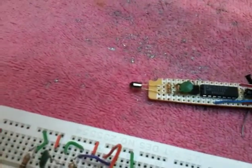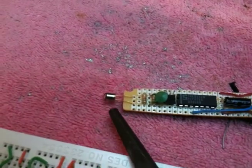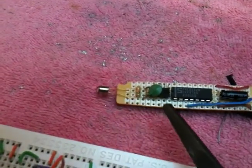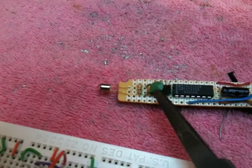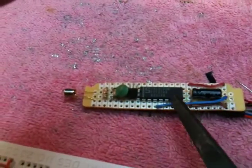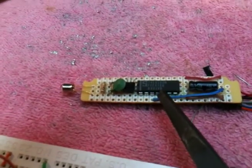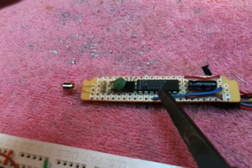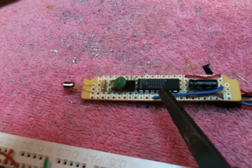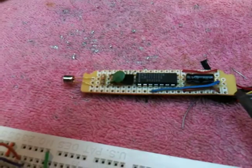There's the phototransistor at the end, I'll use my file to point to this. That's the phototransistor. There are 3 resistors in the circuit, a small disc capacitor. There's an amplifying transistor right here. This is a little IC in which I'm using a Schmitt trigger NAND gate, and then this is an electrolytic capacitor at the end.